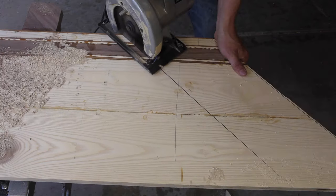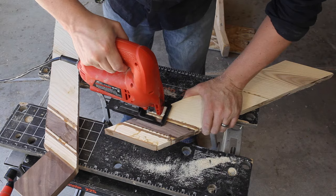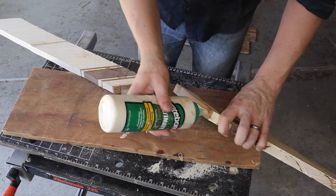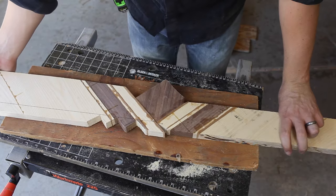When that dries, cut a 45 degree angle like this, then cut that in half. Take the squareless half, put a couple notches in the right place so you can clamp it, then glue that to the square like this. Wait overnight and you'll end up with this.